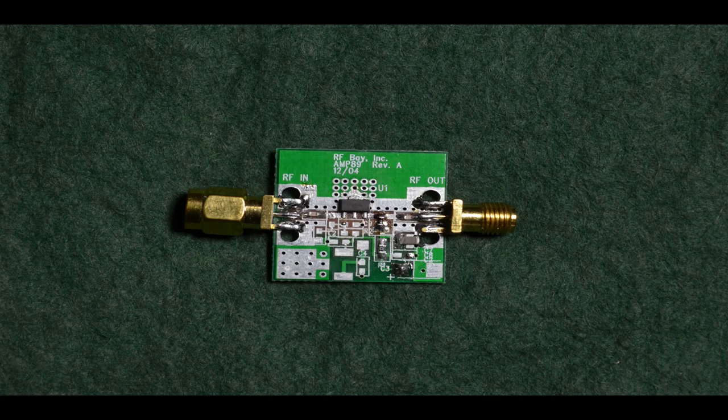So when it's operating in narrow band mode or reduced bandwidth TV, the 8x interpolator is used, and consequently the magnitude of the symbols I send it has to be reduced as well. To simplify things at the moment, I just set the symbols to a magnitude which won't overflow that interpolator. So what that means is that when the higher bandwidth modes are used, i.e. 4 megasymbols per second, the output power isn't quite as high.